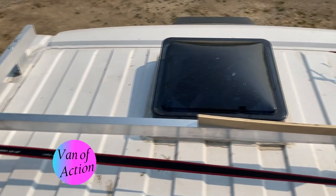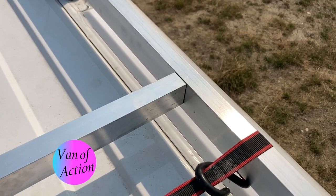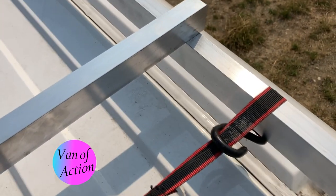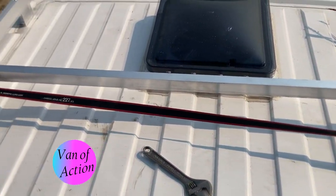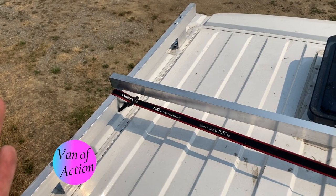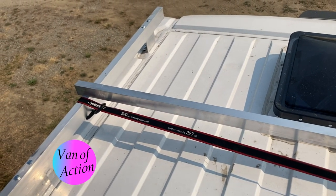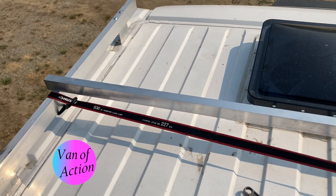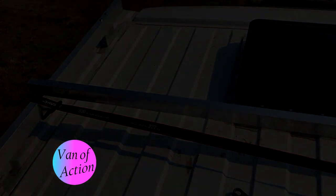I may be getting carried away, but when this piece comes up inside the joint, it needs to be as square as possible — if one side is leaning away it'll cause issues at the corner. So I've loosened off the brackets around the roof pins and used a strap to pull them closer together. There's no way to perfectly regulate how you're pulling, so you need to use a little judgment since one side might come in more than the other. I just want to get them relatively close to square, which will give me a good measurement for the length of the cross members.